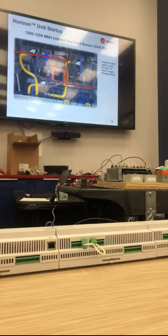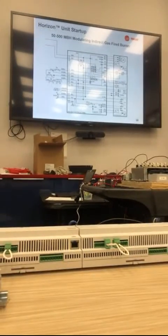It's just to tell you how the startup is, which you should read, or how the sequence goes. I'm not going to go over it, but if you call for heat, this is the sequence that it goes through. It's not really thorough in the IOM. The modulating board wiring diagram. W1 to the left is the call for heat 1. Inducer command, we go low speed, high speed.